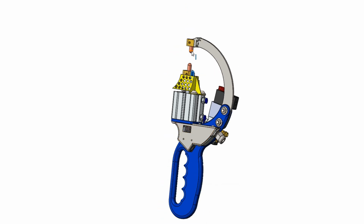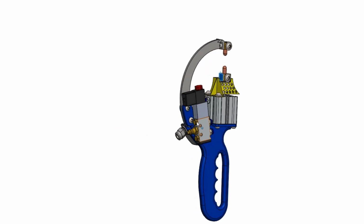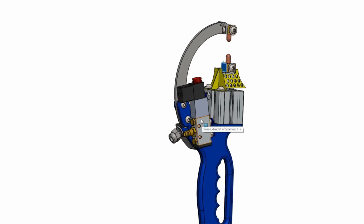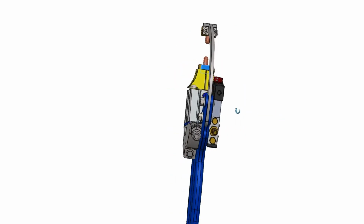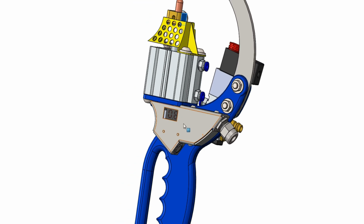So when you finally meet your welding point position where you want to weld, you push the button for longer than 1 second and let go, or even hold it in if you want, but you can let go and the device will do its cycle. Then the signal is sent to this pneumatic cylinder. This is held on until this device in here delatches or counts down.